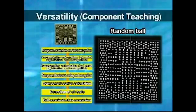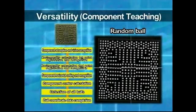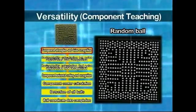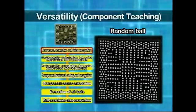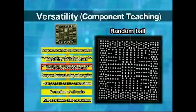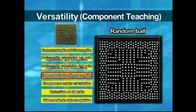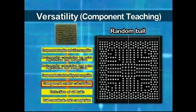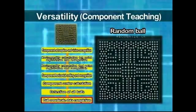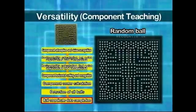Following the increase in high-density mounting and high-cycle components, random ball components are increasing. In Juki mounters, semi-automatic random ball component data production is possible. The component is picked and vision recognition is carried out. Based on the image on the monitor, teaching is carried out for two points, and the component is straightened on the nozzle. The component center is calculated and all balls are detected using the confirm button, registering all ball coordinates as data automatically.